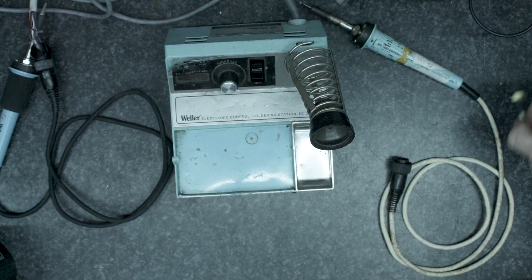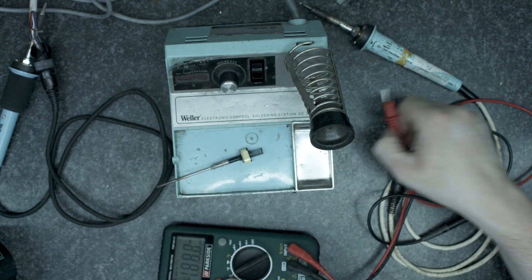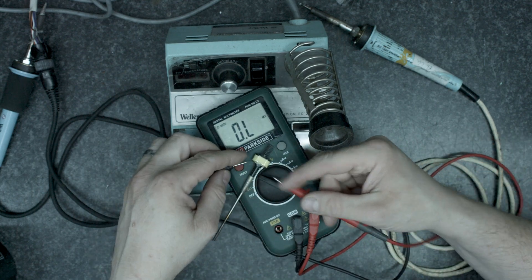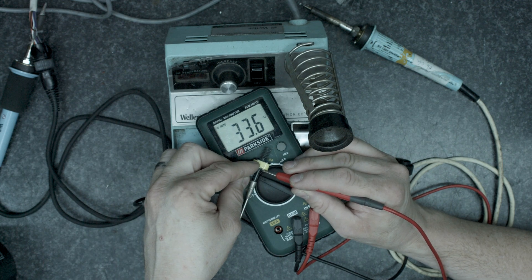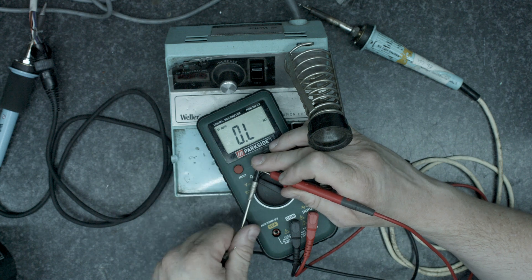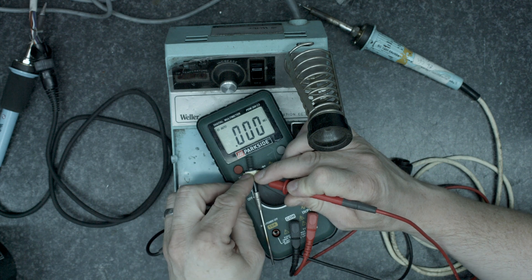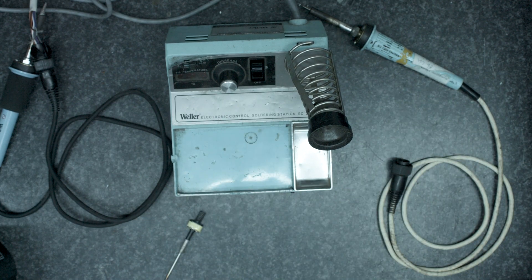There you go — there's the five mega ohms for my fingers. So we have a bad temperature probe. Fortunately I have a spare one — I say fortunately because you can't get these things, they're just not about. Over here in the UK, interestingly this one is giving me 33 ohms, and I seem to remember that the impedance drops on these as they get warmer. Warm that up a little bit — 34 ohms, which would explain that other one giving us a rogue signal.